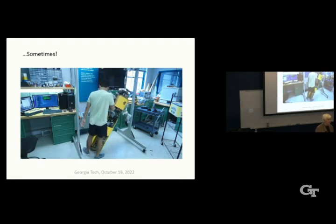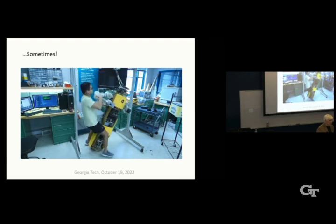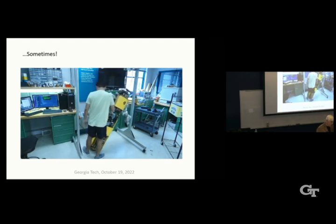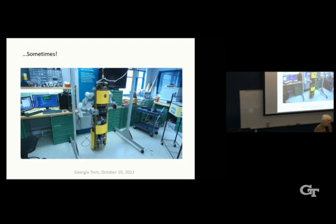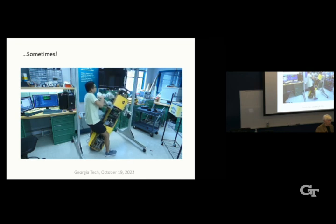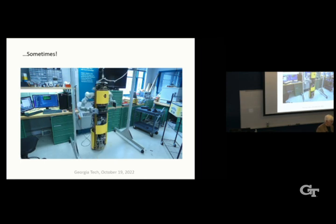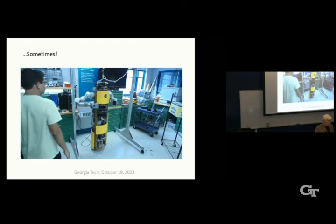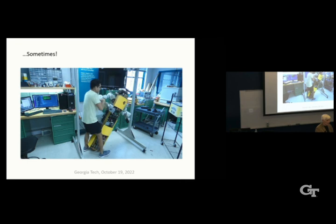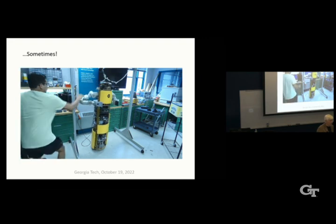The SIMbot, the one with the spherical induction motor, we had operating on a foam mat, because we didn't want to damage the ball. Later, we took that away, and it operates fine on a vinyl floor. So the videos you see, they're there. The mechanical ballbot runs fine on concrete, over steel grates, in and out of elevators, outside on asphalt, sidewalks. And we took one of the Shmoobots to a Lowe's home improvement store where they were selling concrete bags and wallboard stuff. The whole floor is covered with crap, and we just drove it back and forth until the ball was totally dirty, and nothing slips.